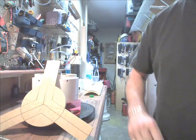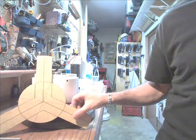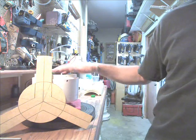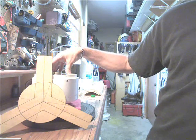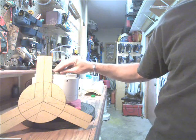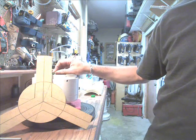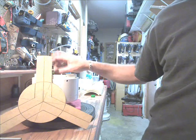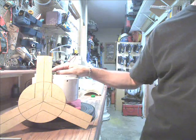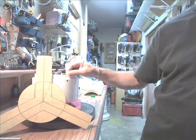That's it for today — just a progress report of where we're at. The next week or two it'll take because I had to order parts. Remember, you don't use your original parts inside your alternator. Everybody thinks you just go out and throw the alternator from the car in there — it's not quite that easy. You have to get a new stator and a new rotor. When I make the video on the completion of the wind generator, I'll have all that information — where you're going to get these parts from and everything.